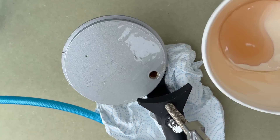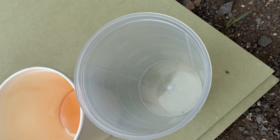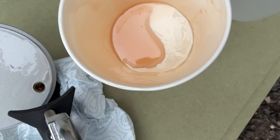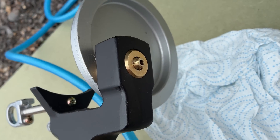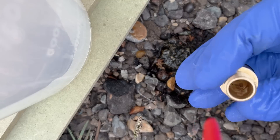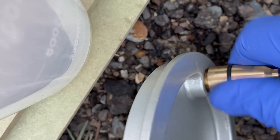Disassembled once more — this may be helpful for those of you considering one of these resin dump guns. They seem to be the only simple ones available, and there are few videos on them. Plastic cup unblemished, and there's of course some wastage resin below where the cup's exit port is. The front plate is resin-coated, as is the inside of the nozzle, and a small drip on the nose. This obviously must be cleared up before the resin cures, otherwise you'll have blocked equipment. The parts unscrew, and the set comes with a squirty bottle for acetone. You could also use an acetone bath, but don't leave anything with a rubber O-ring submerged for long if you want it to last.